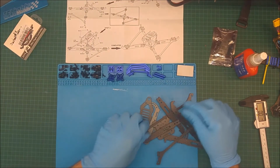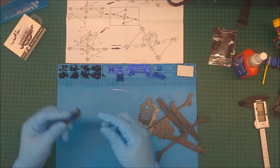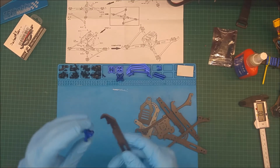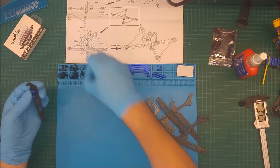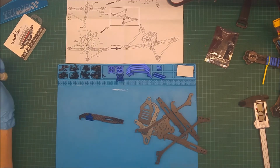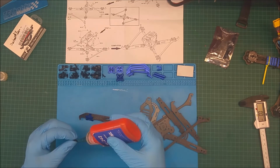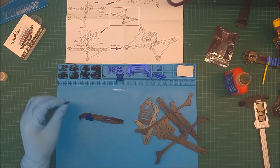First step, just get all the arms, get them set up. The motor stand has a thread inside the aluminum, and you get 3x10 screws. This is an aluminum part with metal screws, so you must use Loctite. Okay, if you don't use Loctite or thread lock, it will come out. So just a tiny bit. And less.